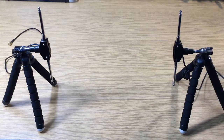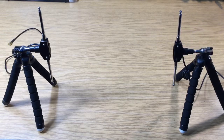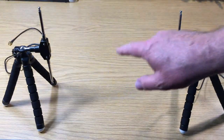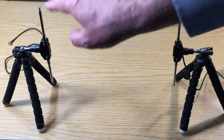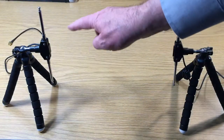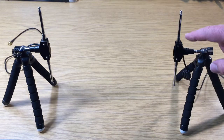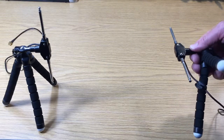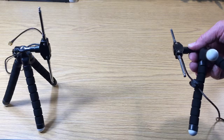This vertical antenna radiates energy vertically and it would be received by another antenna. The law of reciprocality says that a good transmitting antenna is a good receiving antenna. The electromagnetic field traverses in space and is made up of two waves: the electric field, which will be vertical, and the magnetic field, which will be horizontal. To get maximum power transfer between the transmitting antenna and the receiving antenna, these two antennas should have the same polarity. If we change this to a horizontal polarization, we would have cross polarization and less energy coupled into the antenna.